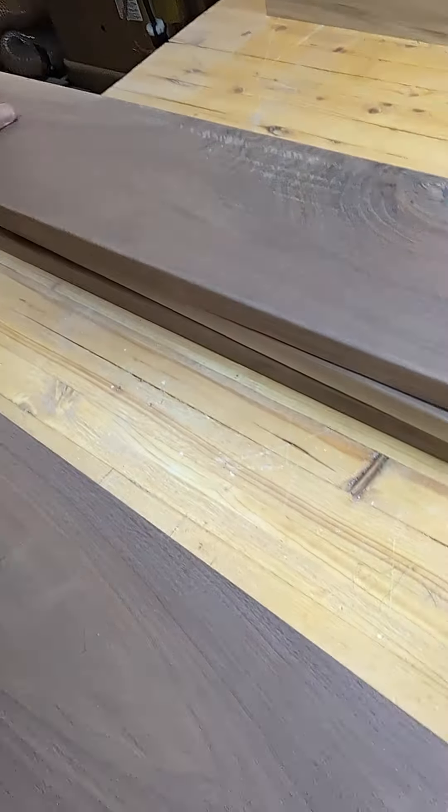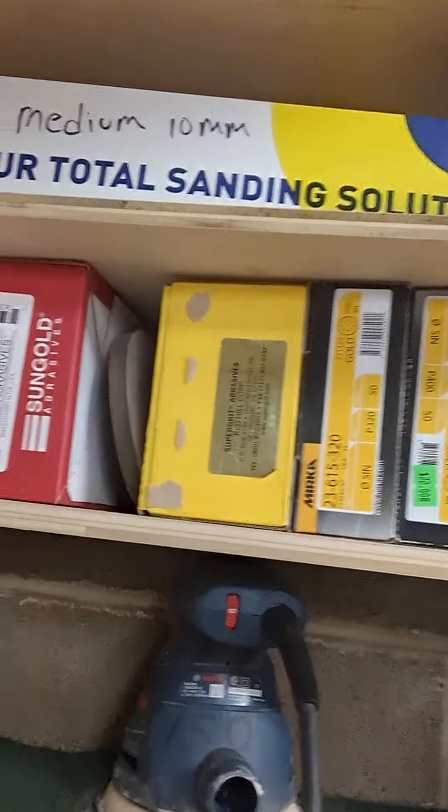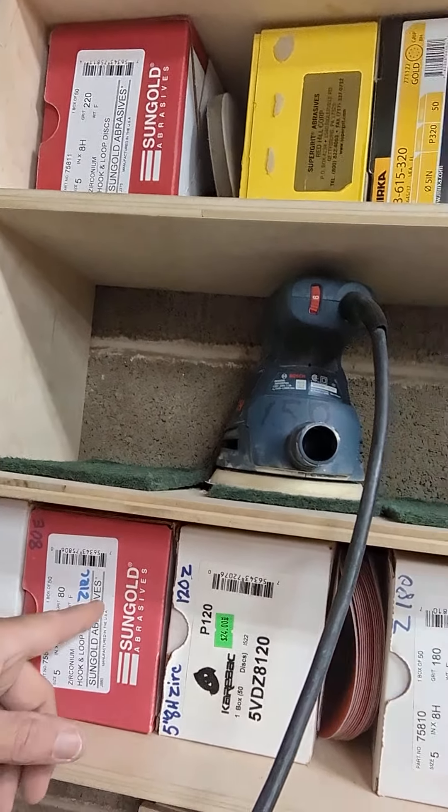And that's process. Look, see all that? That's all sandpaper. It starts at 50 grit and then goes to 80, 120, 150, 180, 220, 280, and 320. Why so much paper? Well, it's expensive and it's a lot more difficult to get a good finish when you go from 120 to 220 to 320 than it is to hit all the grits in between. It actually takes less sandpaper and provides a lot better end result.